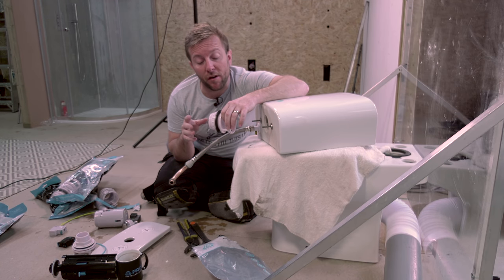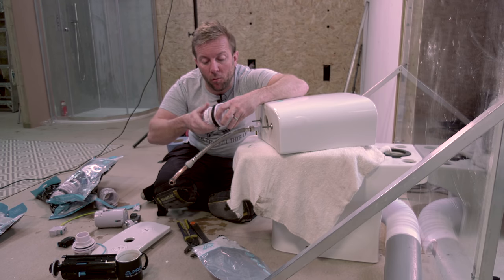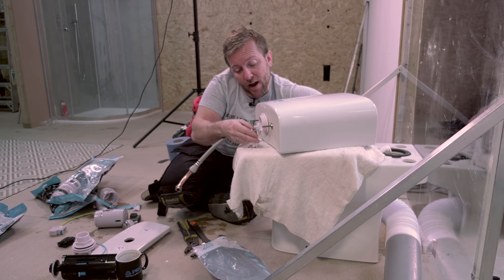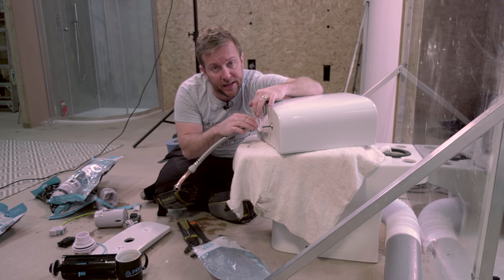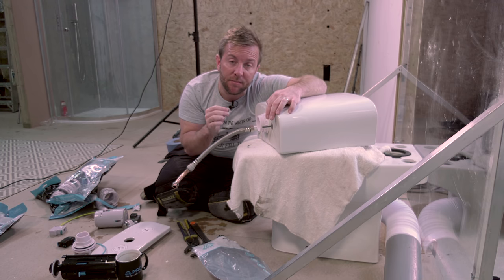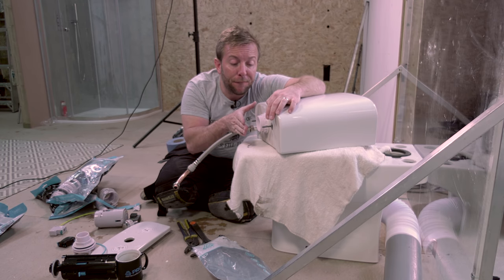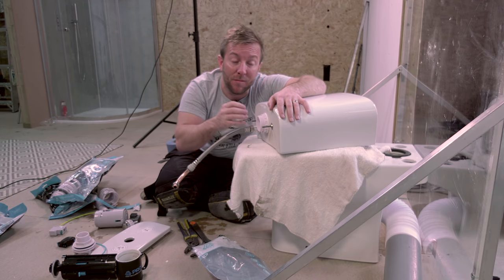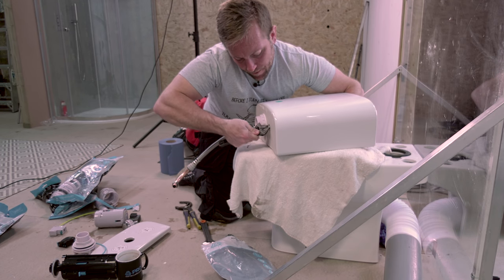So we've got two sizes — the two inch and the one-and-a-half inch. I'm going to use the two inch on here — very simple. We put in the bottom piece, just pop a hand down here and pop that in. We've got a rubber washer underneath and a slip washer to allow us to do our nut up nice and easily, then just do our nut up. Once hand tight, I'll nip it up with those grips. Sometimes this plastic piece here is a bit too long and it hits where it's received in the toilet — you'll know because you'll never get a watertight seal. If it is too long, just get a hacksaw once the nut is on and cut that bit off to leave yourself enough room. Also make sure all fittings are nipped up nicely — see that one there was a bit loose. Nip it up and everything's nice and tight.